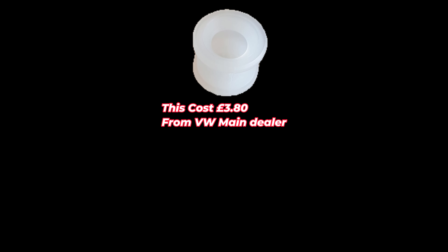It's a fiddly job and it's a job which can cause other problems — it can be a can of worms, it's one of those jobs. But get that block in behind, which is 90mm — well, it's actually going to be a little bit more than that. But if you get 90mm and then get one of these bolsters here sticking behind it just to wedge it in, it gives a solid foundation to put the crowbar on and pop that ball back into the joint.